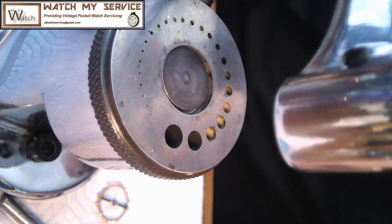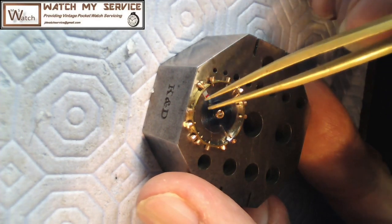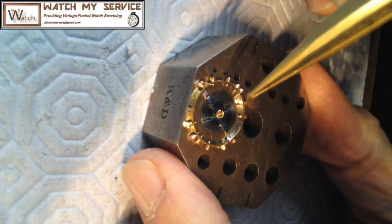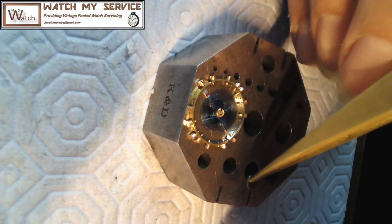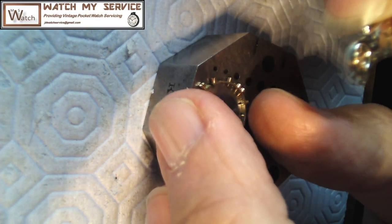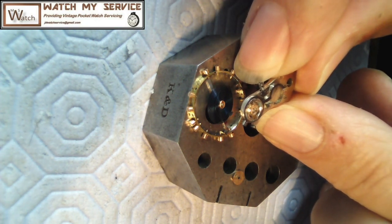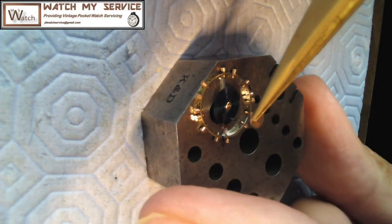That job is done. Now I've got to make sure I've got the impulse jewel on the right side of this balance. There's a little red mark on the arm of the balance that I put there to note where the stud was on the hairspring. If I line the stud up - as you can see right now it's kind of on that side - I've got the roller table ready to line up. I put that on that side, say okay that's where my balance cock needs to be, rotate that around because I had it on the wrong side. If this is perfectly lined up where the stud of the hairspring goes into the holder on the balance cock, then the impulse jewel needs to be on the front part facing where the pallet fork would be.